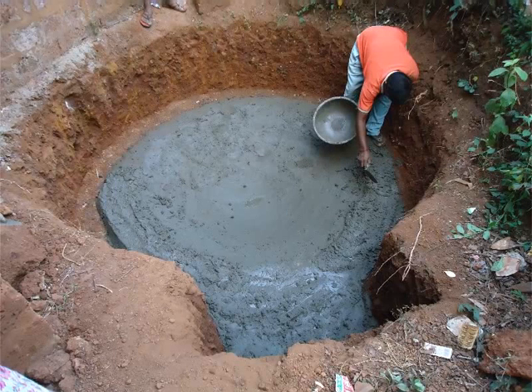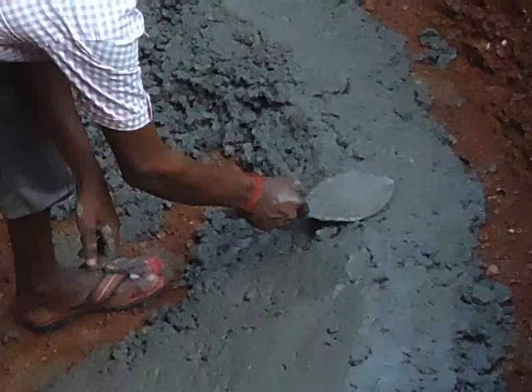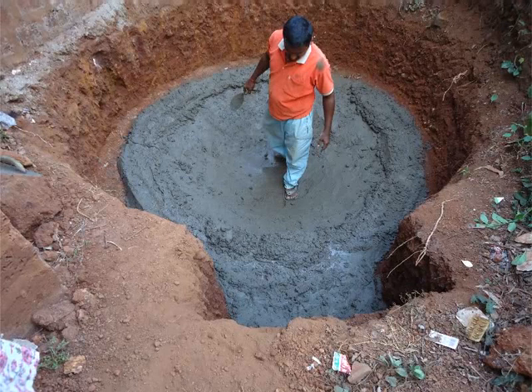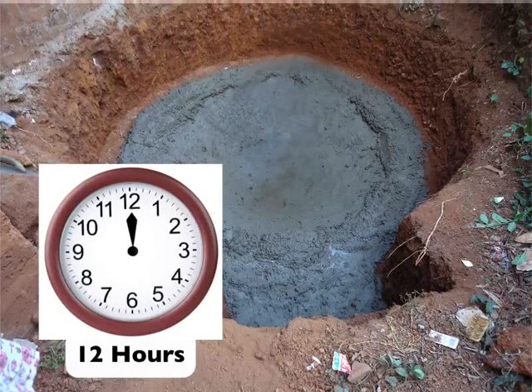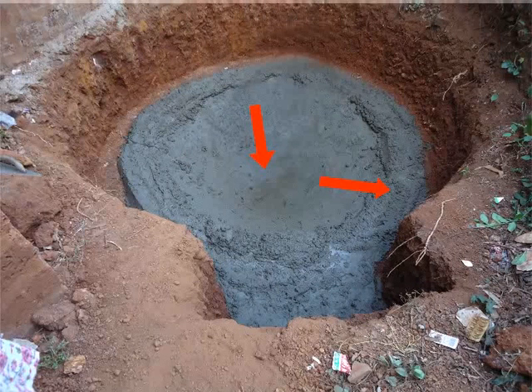Carefully raise the side walls of the pit up to 3 inches using the same mixture. However, do not raise the concave part. Keep in mind the raised edge of the foundation must be flattened using a small trowel. This is to ensure proper balance of the dome after it is placed. After the foundation has been laid, leave it for curing for 12 hours. Notice the elevated walls and the concave pit in the image shown, and also notice the flattened edges.